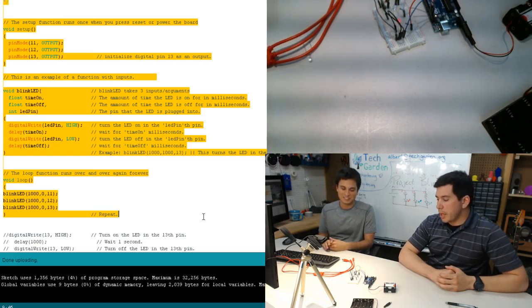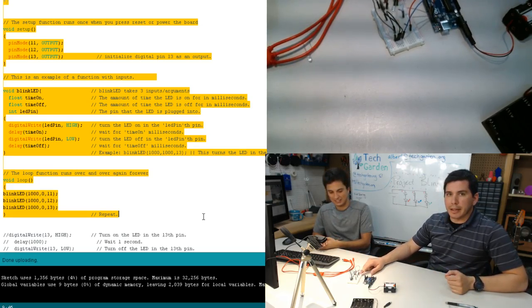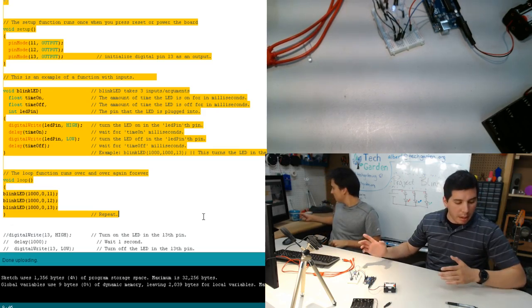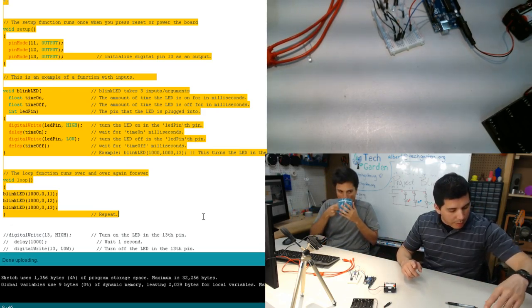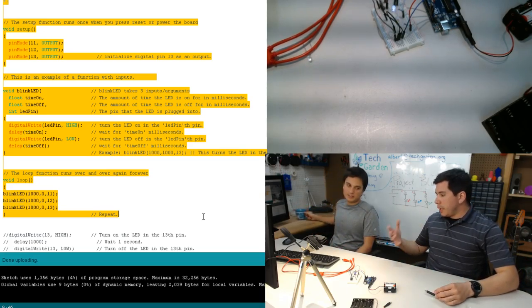Yeah. So if you need something to turn on something that is 12 volts, then it really won't work because the Arduino is only putting out that. But there are ways around that, and I don't think we have anything in our setup. You need a relay, right? We do need a relay.